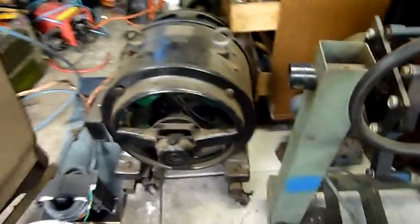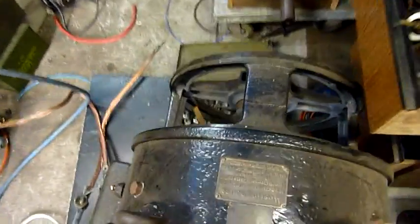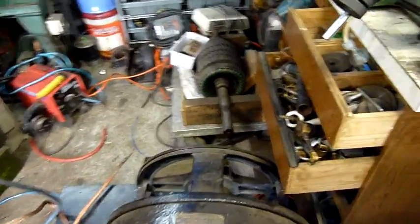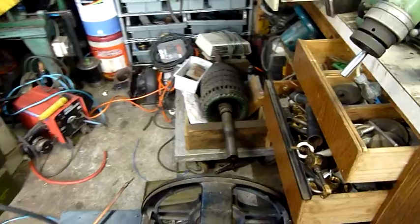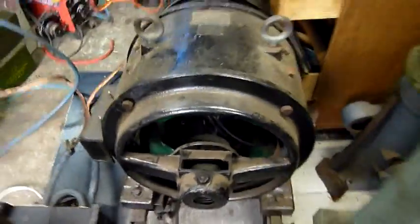The Westinghouse frame is out and that'll be one of my main focuses once I've got the new tool cabinet and everything set up. Now that it's out, it's staying out — I'll just park it over there, and I'll move the armature out to the carport for the time being. The armature still needs to be polished, so I'll mount a gearbox and motor to that trolley and just spin it slowly and polish the bearing journals and the commutator bars. Then it can be hoisted into position. Not too hard.